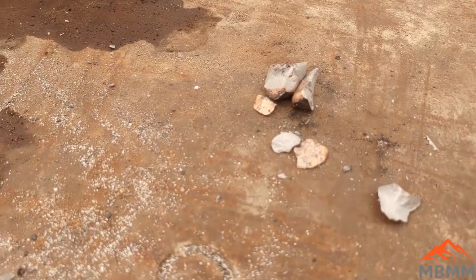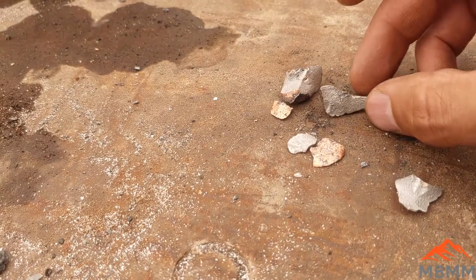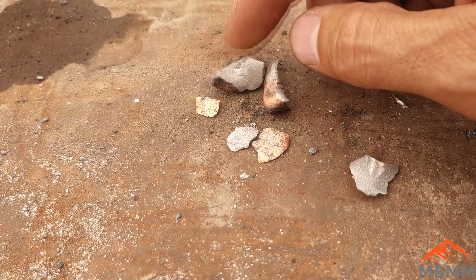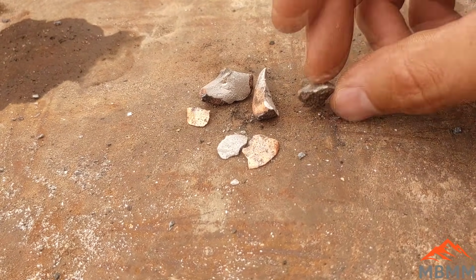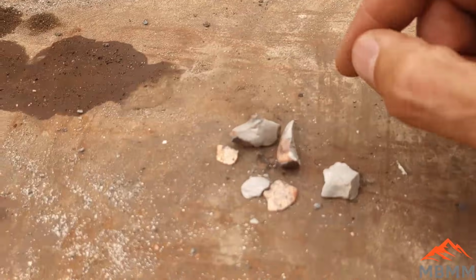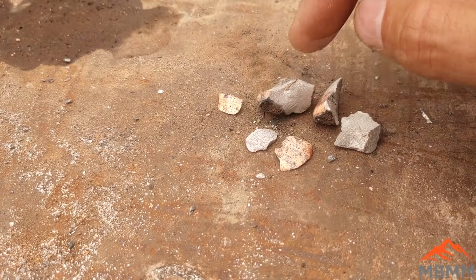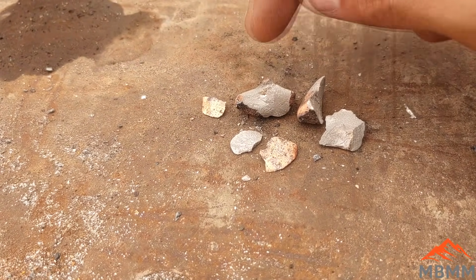Okay, hold on. The mystery deepens here because I took what I thought was our copper bead, hit it with a hammer, and it is brittle as all can be. Shiny silver on the inside, super brittle. I have no idea what that is. It shouldn't be a sulfide, because the sulfide should all combine over with the mat, essentially, is what we made. But I have no idea what this is. So that's kind of interesting. I'm gonna have to zap that with the XRF. But let's try our 10 grams of sulfur and see if we can get some actual metal.